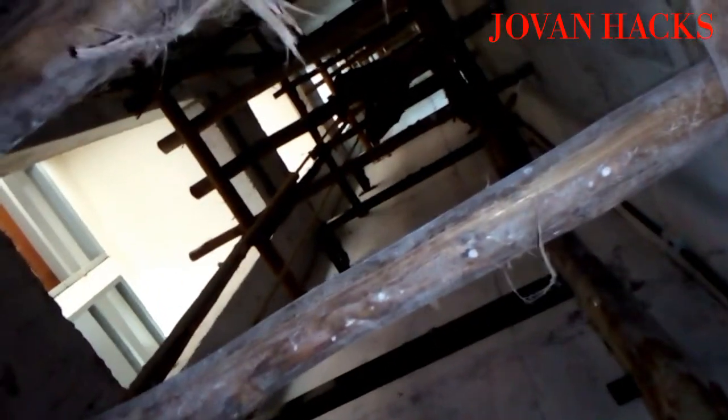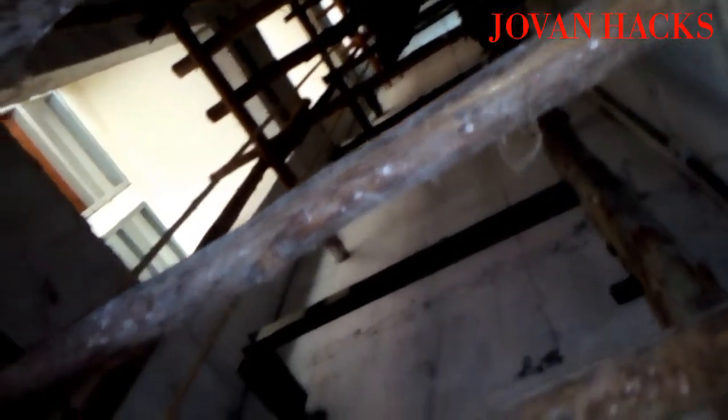I'm standing on the guide — don't worry, I'm safe with a safety belt. The first guides are done. The technician is down in the pit and we're going to attach another guide, joining on top with the male part meshing into the female. We join using bolts. That is how it's going to be done all the way up. We have someone in between helping pull. I'll see you again once we are done.